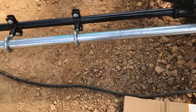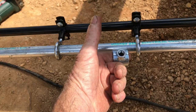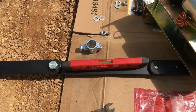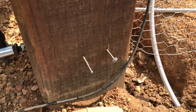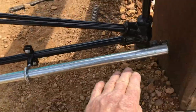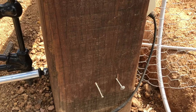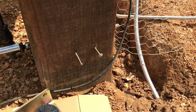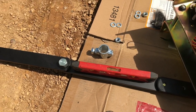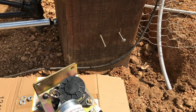The motor arm goes onto a bracket or piece that fits onto the rod. To get the correct heights of the rod, I put my little level on the arm. I've assembled it so that the rod is sitting horizontal, out to the back of the gate post. I temporarily sit the motor onto some nails and make sure it's level with the arm sitting up against the rod.